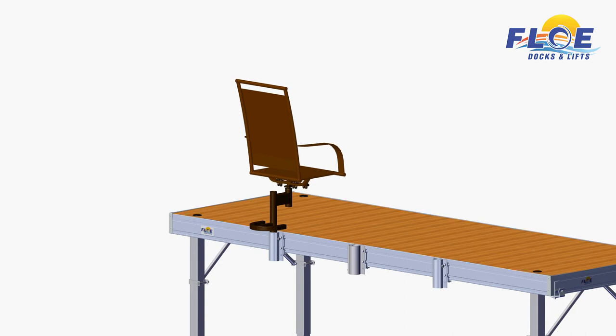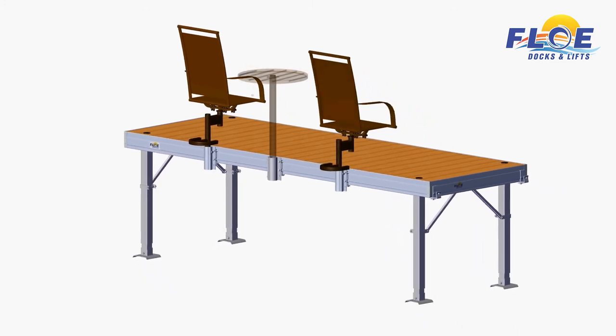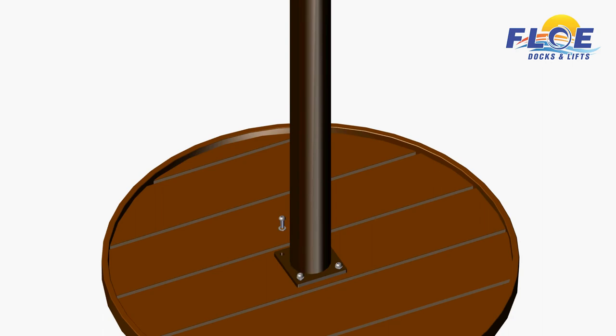If the chair does not slide fully into the pedestal, you may help it along by adding downward pressure or carefully sitting on the chair until it is fully seated into the bushing on the pedestal. Repeat this process on the other chair pocket. Place the tabletop face down on the packaging so as not to mar the table surface. Attach the table post to the tabletop using the supplied allen bolts and washers, as shown. Fully tighten with included allen wrench. Cover each bolt with the supplied plastic caps.